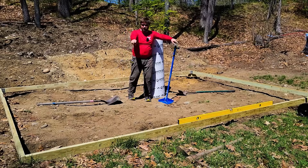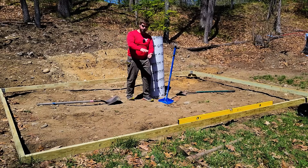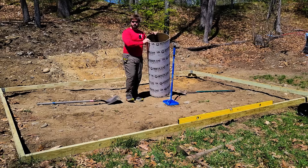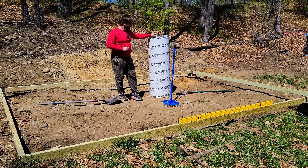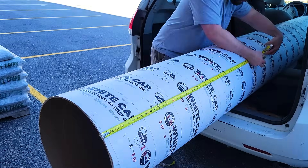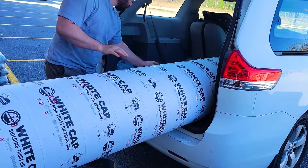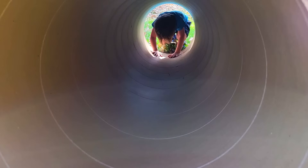The digging is done - all eight footer locations are dug out. Now in this case I'm so shallow that I'm not doing a separate footer to a separate post or pier. I'm going to be using a cardboard sonotube. These are very common - you can pick them up almost anywhere in the 8-inch, 10-inch, and 12-inch variety. This particular one is 18-inch diameter, so that is a pretty big diameter. I had to go to a commercial concrete supply house - they had it in stock. To buy a 12-foot piece of this it was $140, and I had to cut it down in the parking lot in order to fit it in my minivan and bring it home.